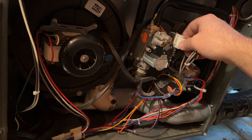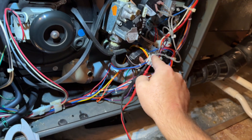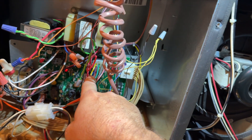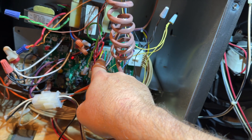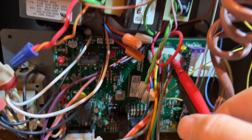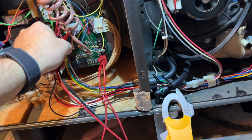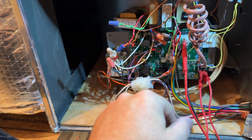We just need to see if we're making a good connection point. I want to be sure we're not getting voltage — sometimes when you plug in the back you're not getting good contact. I've identified that terminals seven and eight is low fire, and eight and one is high fire. No voltage. I'm going to check from the board end, just make sure it's not the wire. On seven and eight — that's low fire — I have voltage. So it's not making it through. We might have a bad connection.